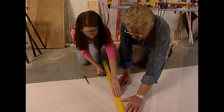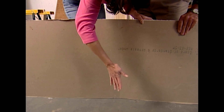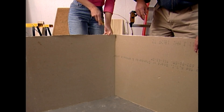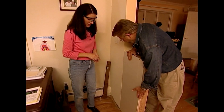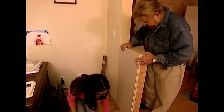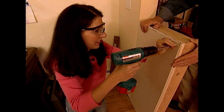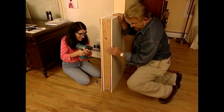When the frame is secure, we head to the garage and start cutting the drywall that will cover it. First we score the paper on the face of the wallboard, then stand the panel on edge, break it along the score line, and finally cut the paper on the back. Ben starts screwing the half-inch wallboard into place. Now we make it a real wall, closed on both sides.